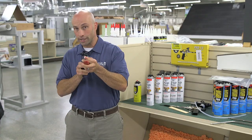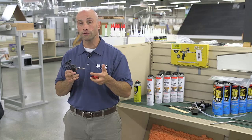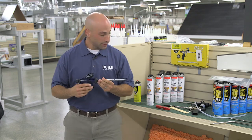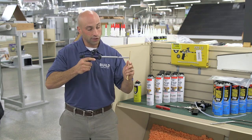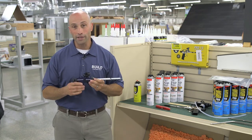Knifing the tip will damage the retractable pin, which will allow air into the barrel, cure the foam, and you're going to have a problem. Instead, the proper way to clean the tip is to use a piece of wood like a shim or a 2x4 and scrape it off — that's not going to damage your pin.